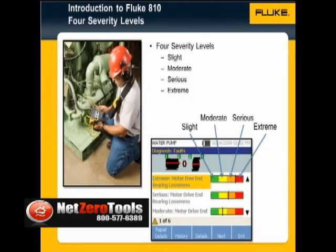In order to assess the severity of the fault condition, it will compare the measured vibration amplitudes against its internally generated vibration thresholds, which simulate like-new machine conditions. It will compare your machine's performance to similar machines in its database, and identify abnormalities.